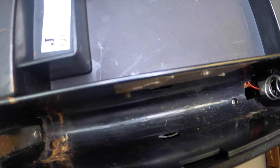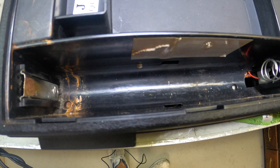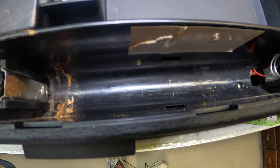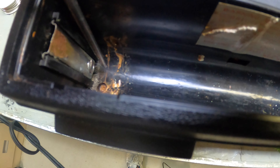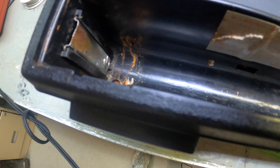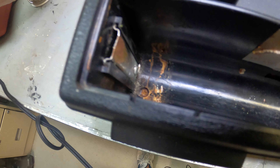The big problem I come across — and you'll come across this all the time — is the battery compartment. That's really where the problem comes in. This thing was loaded with six D cell batteries and they were leaking, rusty, and there was acid everywhere — a mess. I cleaned it out as best I could. There's some dirt here I need to sand down. This spring here is nice and clean, but this spring here is missing. So this is what it's supposed to look like, and it's missing, so the batteries won't reach the contact.